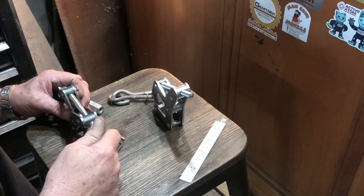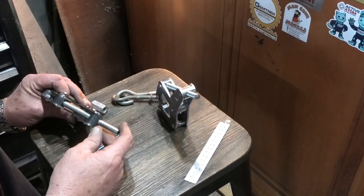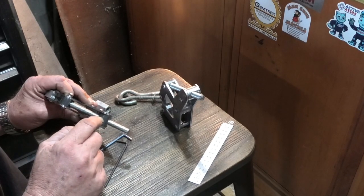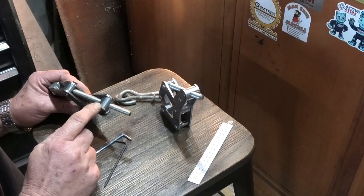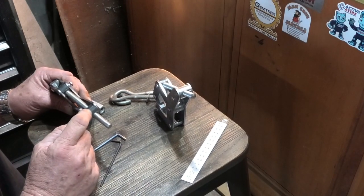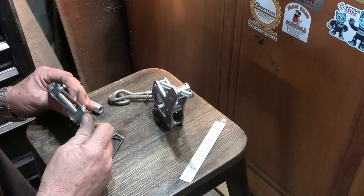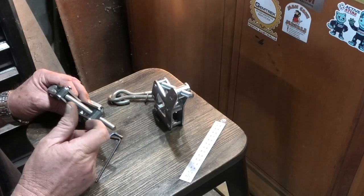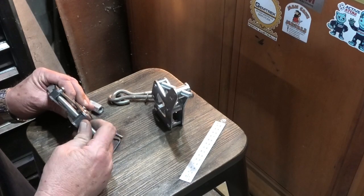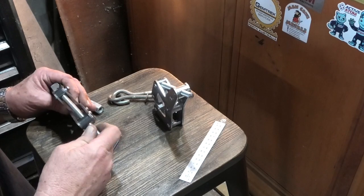it's okay. There is a problem. It works fine, but I know that the alignment of this screw is slightly out. I would say the thread in the nut here was cut on a slight angle. I started the thread with this clamped in the mill, and I know at one time I had problems, one of these turned around on me. Can't remember which one it was, but I caught it and reclamped and started again. This could have been it, maybe. But it's working smooth.